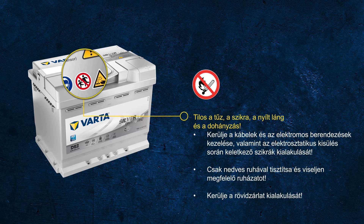A spark can also occur within a heavily used battery with damaged lugs or plates. Cells with high electrolyte loss — for example due to an internal short circuit — can contain a high amount of gas. Therefore handle those batteries with care. Also be aware that electrostatic discharge can cause a spark.